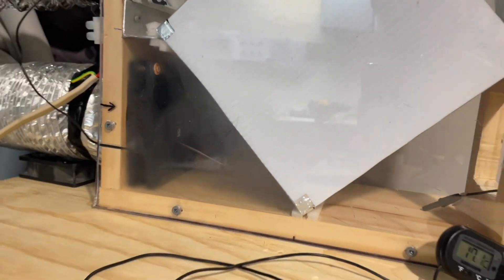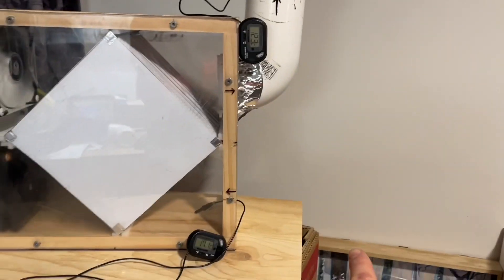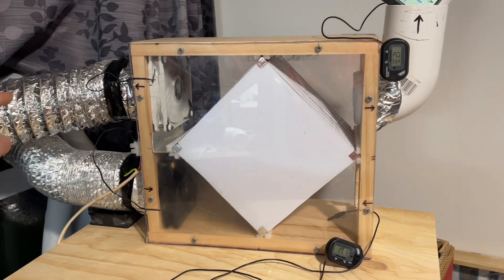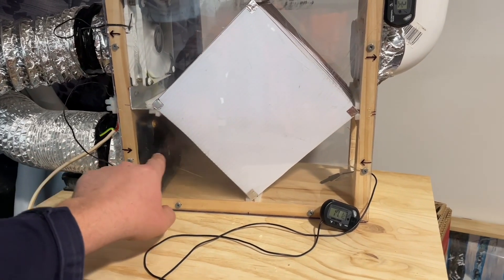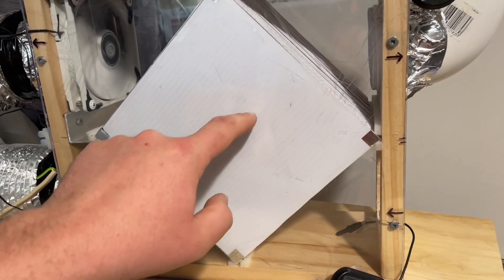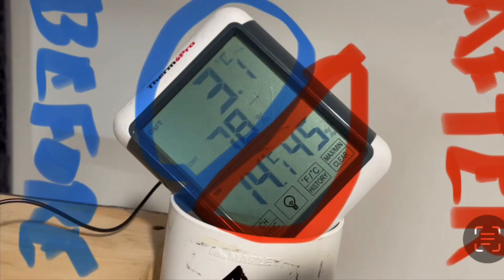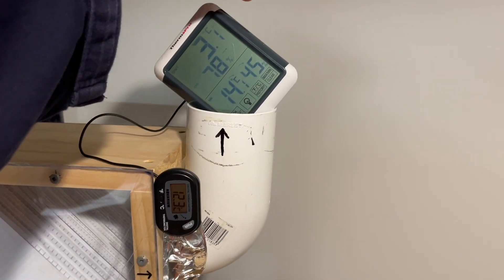It's even starting to fog up a little bit on this corner. The room air comes in through the heat unit and then outside, and fresh air comes in through here. You can almost see the lines it's going to follow. I've got a thermometer outside — the air in the blue is before it enters the heat exchanger and the red at the bottom is after it's exited. We can see it's both warmed up and become a lot drier, changing from 78% humidity down to 45% humidity. I'll explain how that works in a second. I'm pretty happy with these results — it's a good dehumidifier.